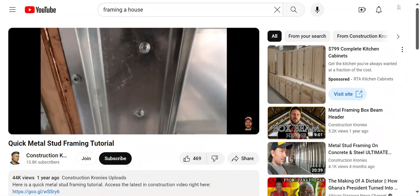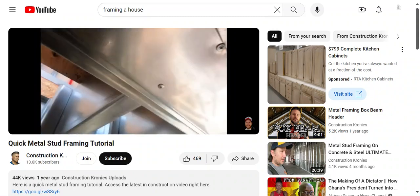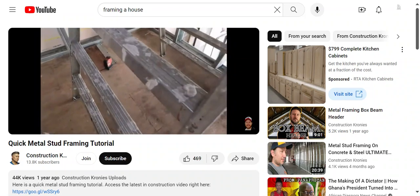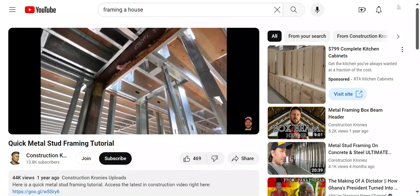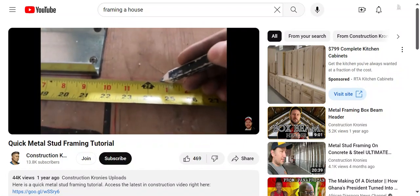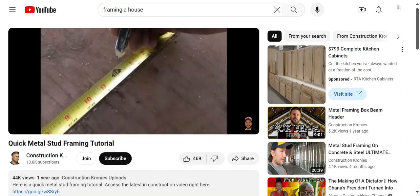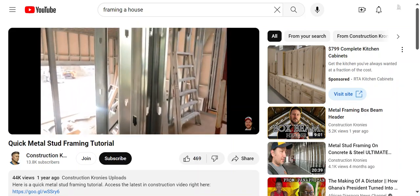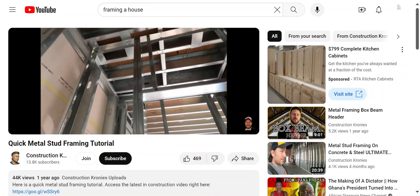I always put a clip where the corner lands and then every two feet I add another clip for the top. I don't have your drawings but you guys are responsible for your layout — it's super simple, just copy the drawings. Because the ceiling elevation is different heights, I'm using two pin lasers to plumb up either side of the door. Normally I would just plumb up one side and use my tape measure to measure across. I'm marking centers on two-foot centers, and because it's coming off that wall I'm coming out an extra five-eighths to allow for the drywall to pass through. Shoot in your elevations, put two studs on either side of the door, always go off your high side, and mark your door elevation on both sides of the studs.